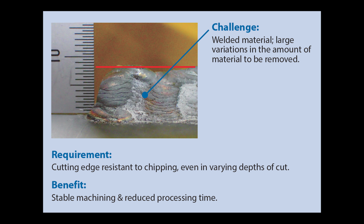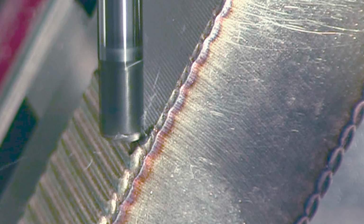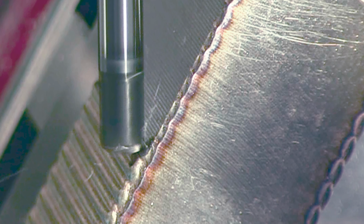In comparison to a part that was roughed out completely from solid, a rough 3D printed part will usually have much higher surface roughness and a lot more fluctuation in how much material there is left to remove. This means that these parts will still require subtractive manufacturing to bring those products to a finished state. Because of the fluctuations in remaining stock, manufacturers take excruciating amounts of time to slowly remove the excess material. There's really no way around this.